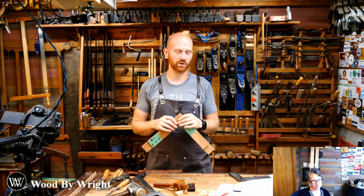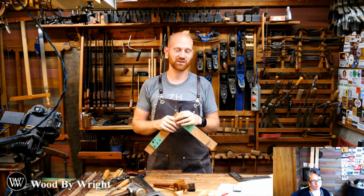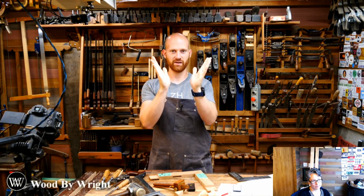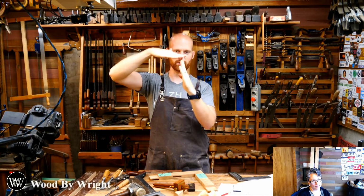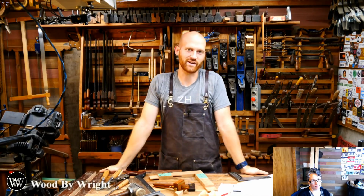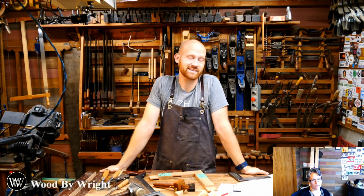I think once I finish this, I'm going to do the sunrise dovetail joint. Which is basically a dovetail joint, but rather than having just a dovetail, it has a series of fans that are all at different angles. And so the boards, rather than coming together at 90 degrees, come together at an angle and spline together. It's kind of a fun, challenging joint. We'll see if I'll do that one. I don't know. But yeah, the more challenging, the better. I guess that's my favorite.